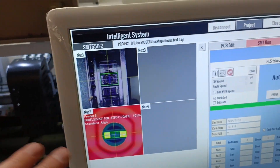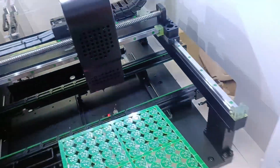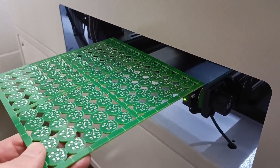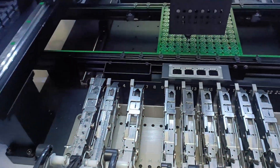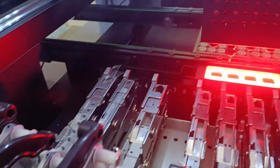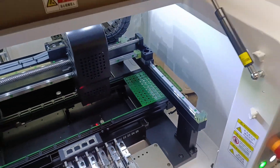You can see the last camera position — it actually pictured the diode and shows it here. It's only placing four diodes because I don't want to place the whole board, and I haven't put paste down or anything else. But it's in auto right now. As soon as I put the board in, it takes it, clamps it in place, checks the marker position, and then comes in and places the components. They're a bit random all over the place, but it's doing its job, and then it sends the board down again after it's finished — which is pretty cool.